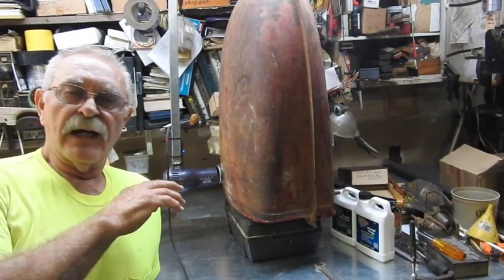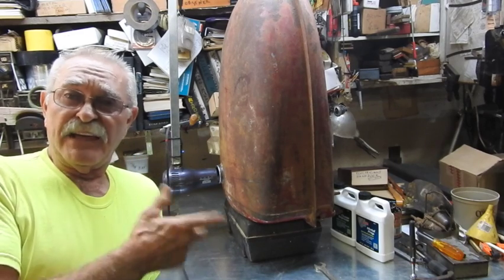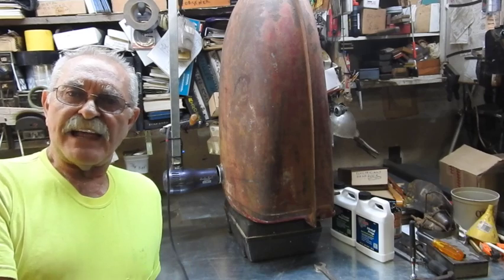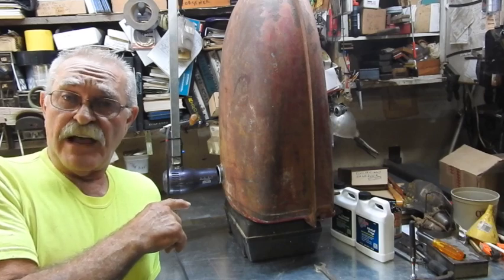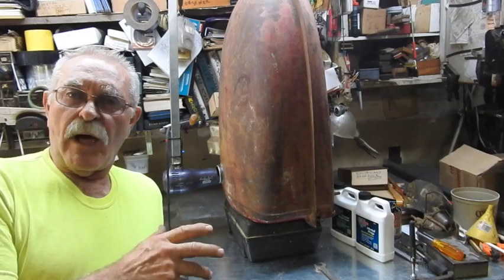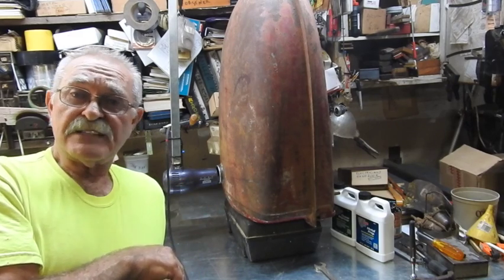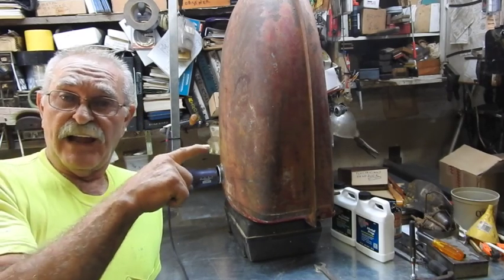So you saw start to finish the typical things I do to get a completely rusted-up gas tank back in service for these old tractors. It's not for the faint of heart — it definitely takes some time and effort, especially these ones with the baffles. The ones that are shorter and squattier, like on the Massey Harris's, typically do not have a baffle. But Ford gas tanks and International gas tanks so many of them have a baffle, which makes it much more difficult. I don't believe the end result is quite as good because there remains a portion inside — the actual baffle itself — that you just can't get the coating on. The next video is going to be getting this thing on the tractor and getting this tractor fired up. This is TrackerMan44, and I'm out of here guys.